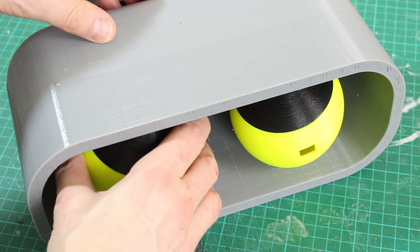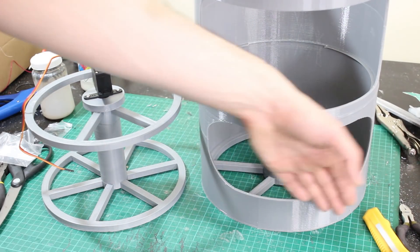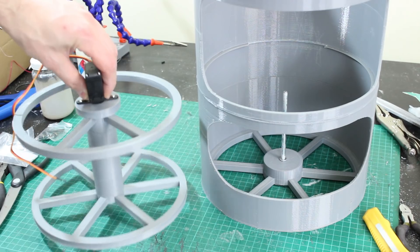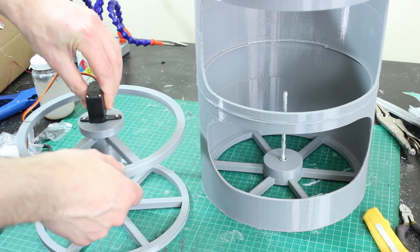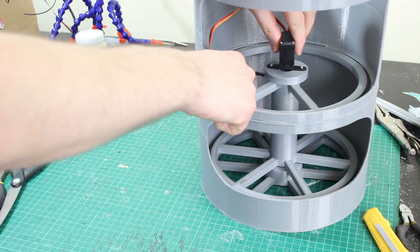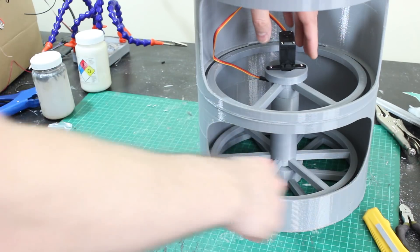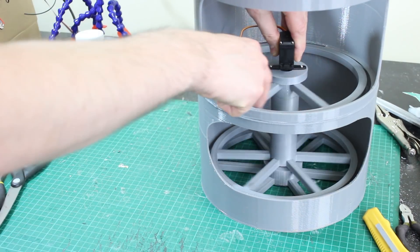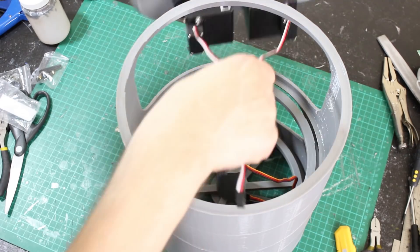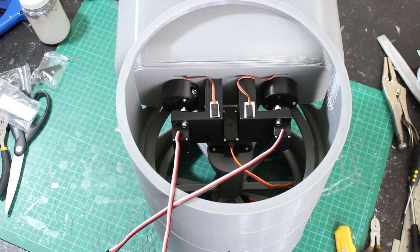The eyeballs move forwards and backwards and the other servos are fitted in the back. For Bender's mouth we're going to have a piece of acetate on here with his teeth drawn as vertical lines, and then wavy lines that move inside to do different mouth expressions. What I'm going to do is put this carousel in, which has got a servo on it — that's going to mount like this and rotate around. This will have an illuminated thing on the inside with a yellow sheet for the mouth expressions. It can do just over 180 degrees, which means his mouth can form different expressions. The servo fits neatly between his eye mechanism, but we are going to have a bridge to the back and some other stuff to hold the illumination.